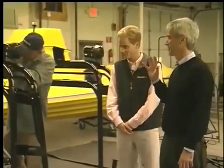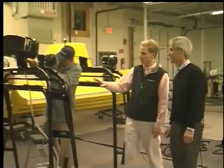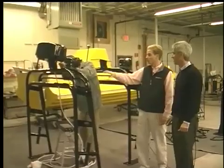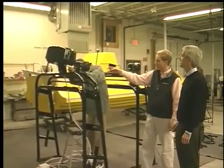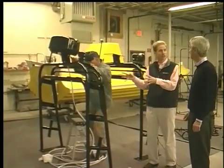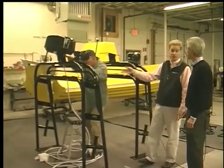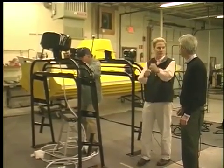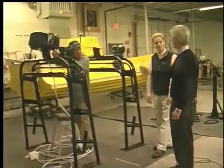Matthew, we just moved to another part of the factory. We're in the rigging section where we have antenna arches here that go to the back of the boat right over the engines. What we're doing right now is installing spotlights, radar antennas, any kind of lights or antenna mounts — all that stuff happens off the boat. We feed all the wiring up through it, so that's what Phil's doing right now. Once he's all done, this is all one package and we then take it and bolt it right onto the transom.